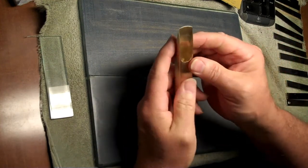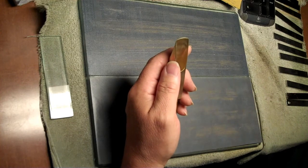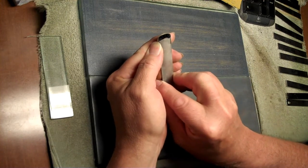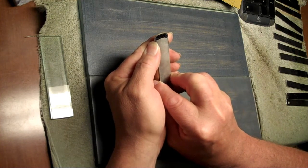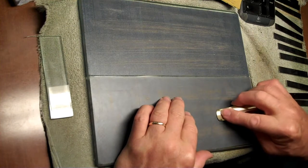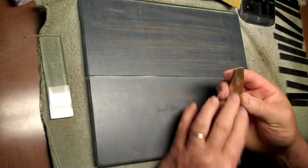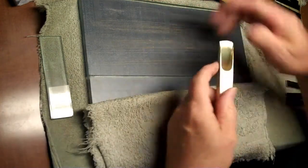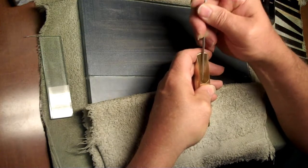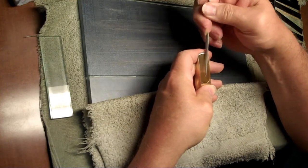So you see, as I open up the tip, the tip rail gets a little thicker, gives me some real estate to work with. I use these metal reed templates to shape the tip, which is pretty good to start with, but I'll adjust that a little, take a little bit of material off here, off there to get the shape to match the average reed shape better. The tip rail to create a thickness that we like.